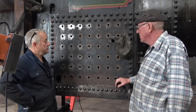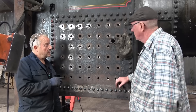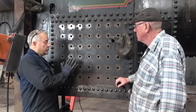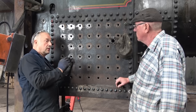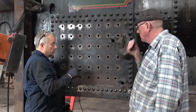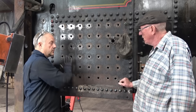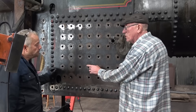Today's job, we're going to be drilling holes and threading for the stays. The stays basically are going to stop the boiler pressure pushing this big plate out - the outer firebox plate - and the inner firebox plate from pushing in. In essence we're going to be drilling holes, threading them, and later on we'll put some specially made threaded bar to hold these together, to basically stabilise them. The original holes we're going to make bigger.